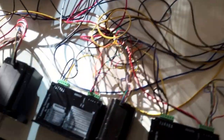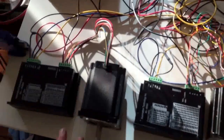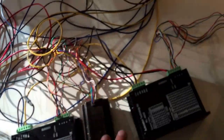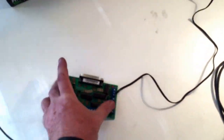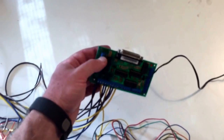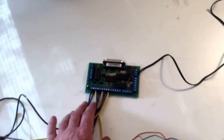Here's the test bench for the three-axis motors, the controllers, the board, and the power supply. My first issue is this board - this whole pin cable parallel port thing died years ago. It's dumb, I can't believe they still make stuff like that today. I'm going to see if I can order a USB board with a USB connector instead of this printer port, because you have to order so many other things to get a printer port to work in any normal computer today since most don't have printer ports.